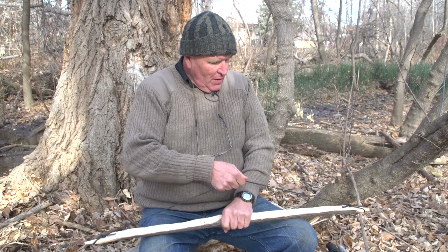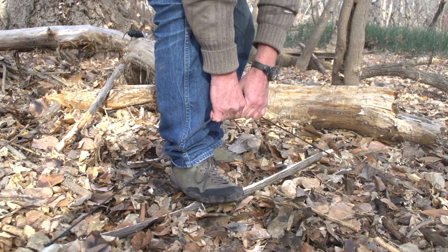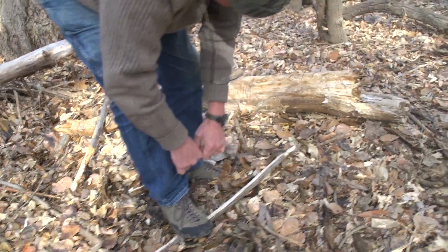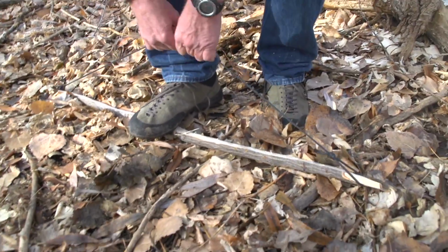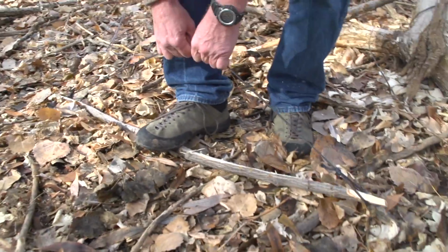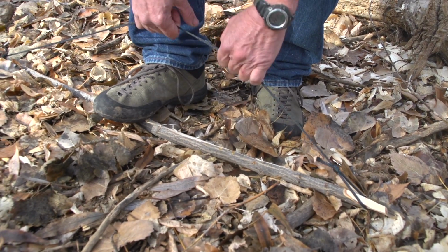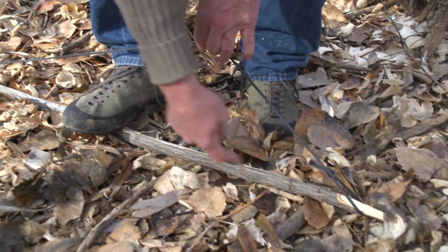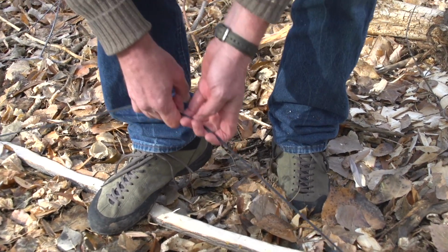What I'm doing with this is I'm going to use this to tiller. I have what's called a hinge right there. I've gone too deep and I don't have enough flex out here. On this side it's bending pretty good. But right here, you can see it's just bending right there. I've taken too much off there. So I have to take off a whole bunch through here to lighten that up.